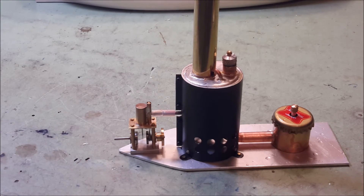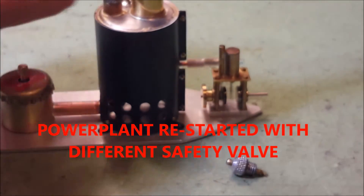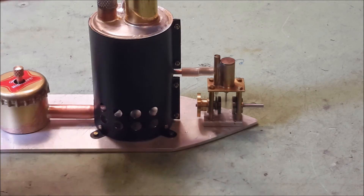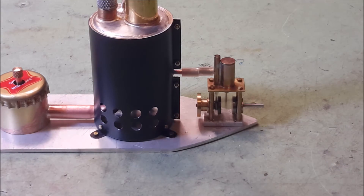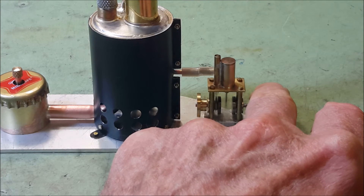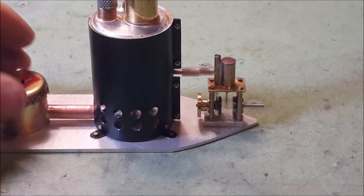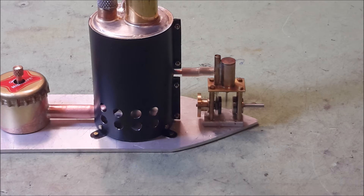Looks like I got a pretty bad leak on my pressure relief valve. I'm running the engine a second time with a different pressure release valve, so this one seals up a little bit better. And as you can see, the engine is running quite a bit faster. That's good because when it's under a load — when I have the propeller and stuff on — it will slow down a lot. I can feel the torque on the shaft now; it's pretty good. With a tiny engine like this and a tiny boiler, just a small steam leak can rob you of a lot of performance.